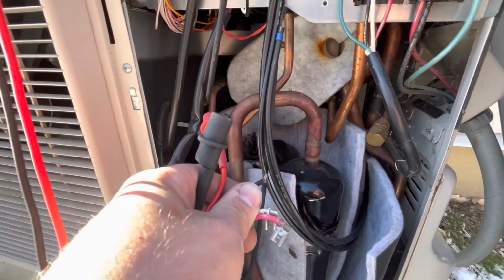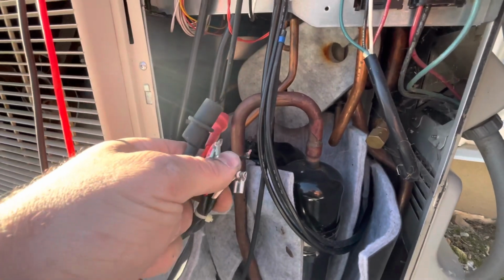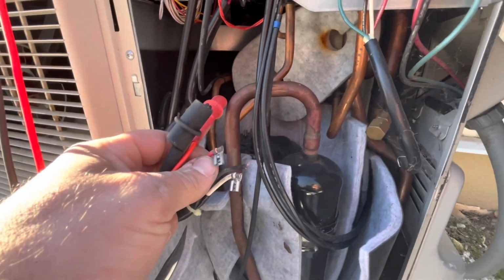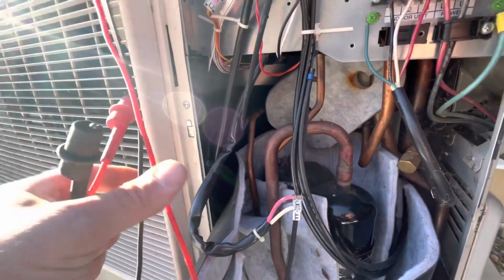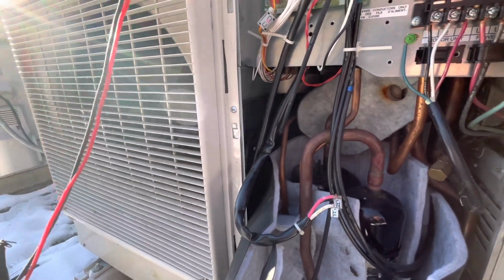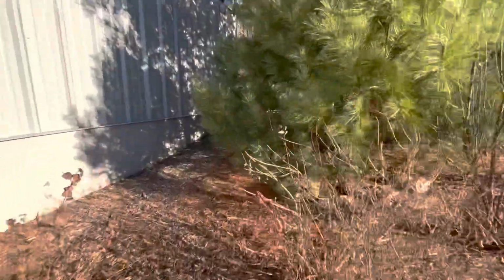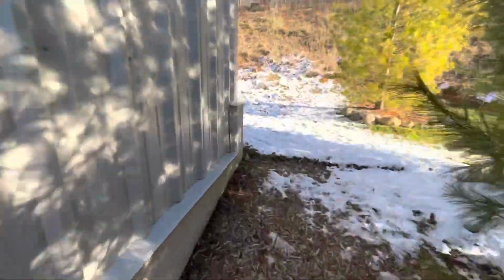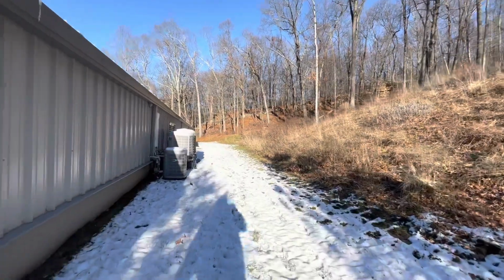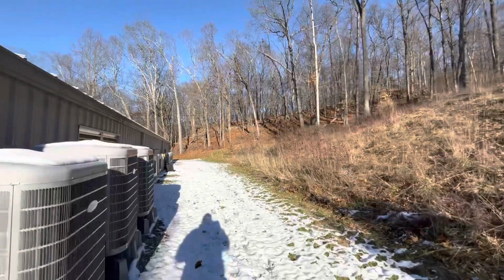But again, why did it burn off? But I'm going to put some electrical tape around this, put these two back on the proper taps, and then see if I can duplicate the same 9 and 5 blinks, that I think it was 7 or 9 and 5 blinks, but it was a compressor motor error. So let me do something. Throw that Molex connector back on, stake on, whatever you want to call it, back on that compressor. I'm going to put one on and see if that fixes the problem without having to call tech support. But first I want to check my resistance values.